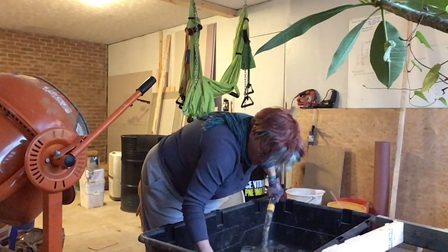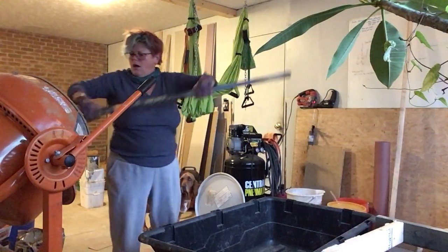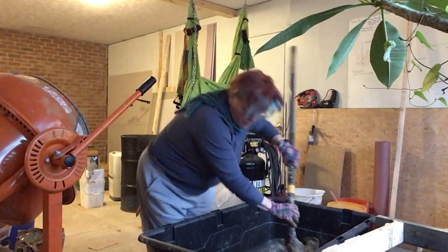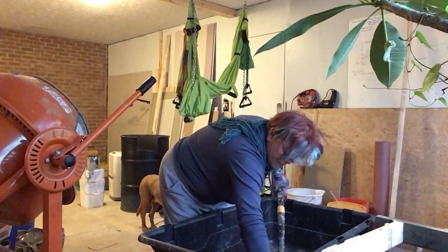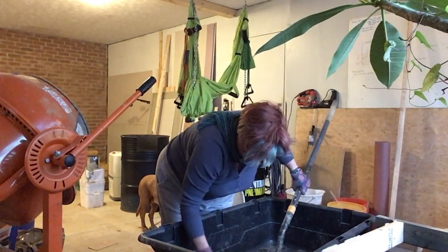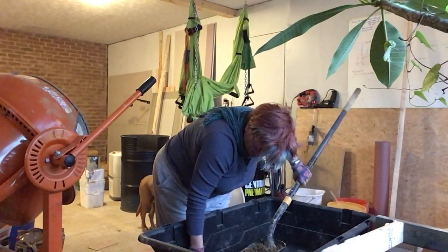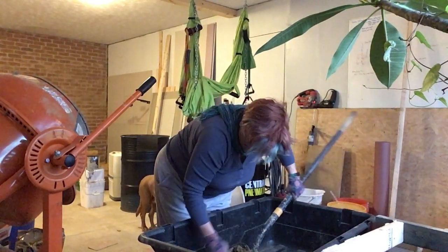So with that said, now you can put that tank really freely wherever it can go in the system. You can put it right over the edge of the riser, right on the tank. Absolutely, because the water in the tank is going to protect that steel from ever overheating.